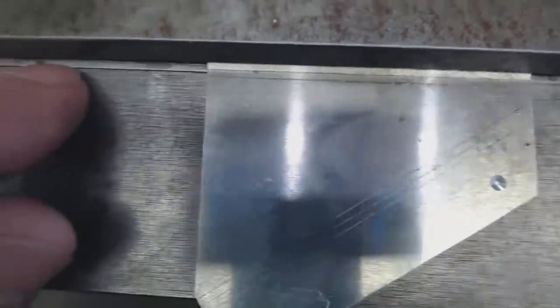I'm going to bend this plate. I wanted to show you how I have this in here. You can see the center bending line is on the bend line here. We're in the center, so the center line is there. This bar is on the outside line.